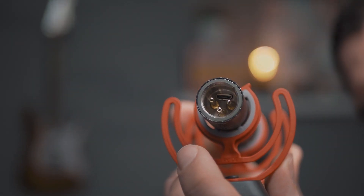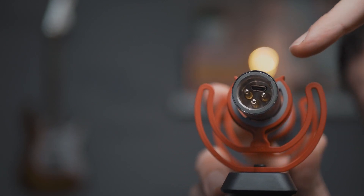Why these three microphones? The Zoom F2 has a 3.5mm jack input — no XLR — and it does not deliver phantom power, meaning any microphone plugged in needs to handle its own power. The Rode VideoMicro doesn't need anything other than plug power, which the Zoom F2 does offer. The NTG4 Plus has an internal battery for phantom power and can be charged via USB, but the USB connection shares the same port as the XLR, so it can't be charged while in use.